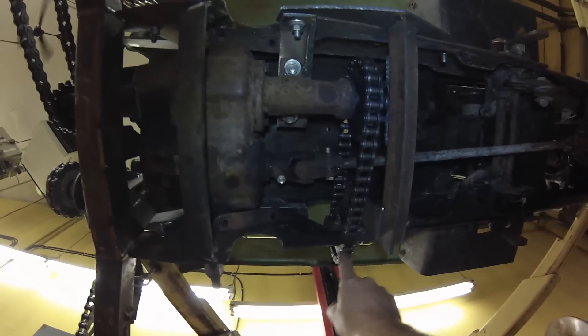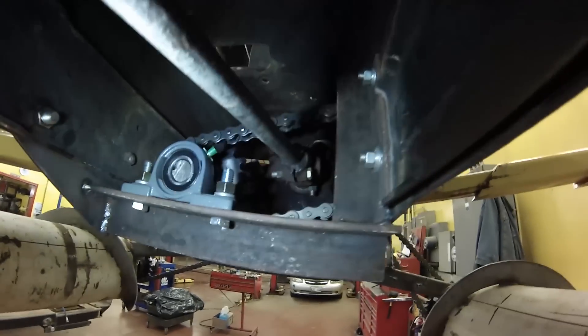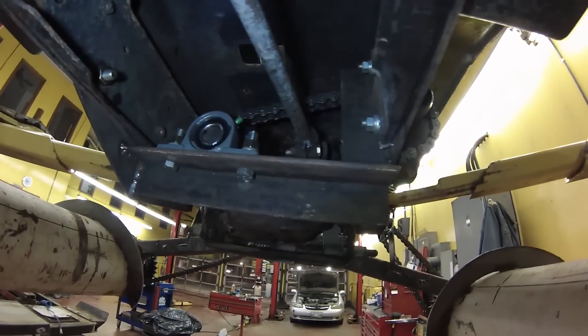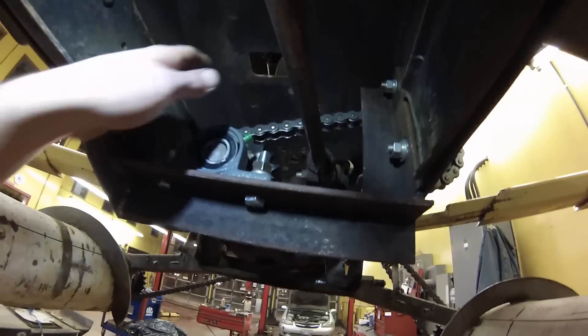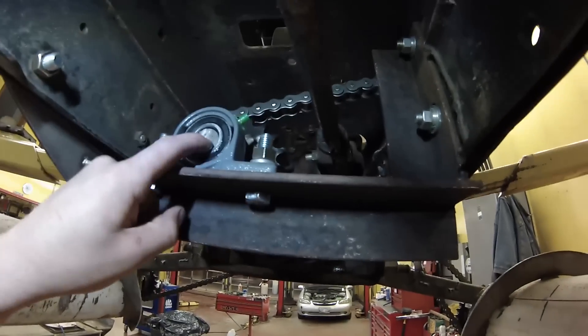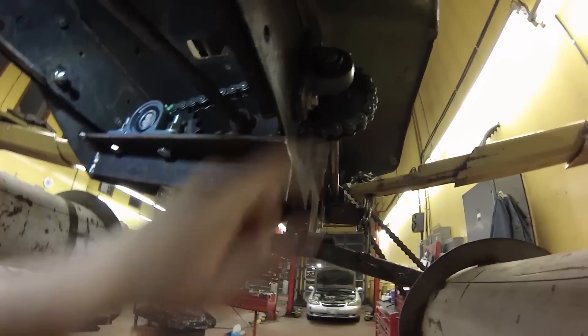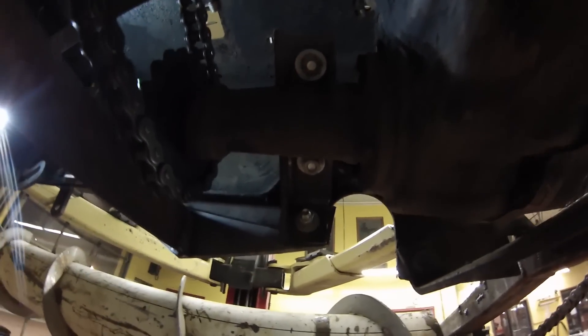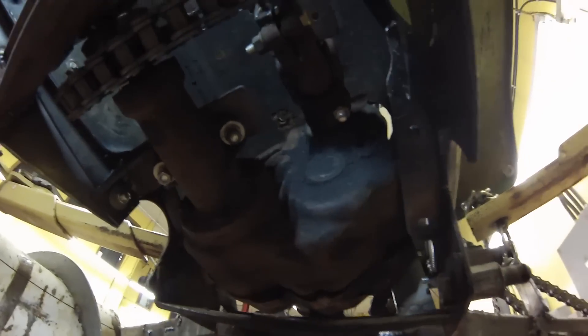The jack shaft is going forward to the second screw. I've also put a hanger bearing on the end of this axle and braced it all with angle iron up to the second bearing, because the way this chassis is designed the tunnel is just a big U-shape — I need something to tie the bottom together. This way the chain pulling won't be able to pull this axle shaft towards the jack shaft. It's all fairly well braced, and this shaft is basically double-hung with a mount in here, so hopefully that doesn't break.